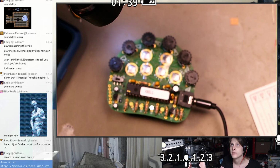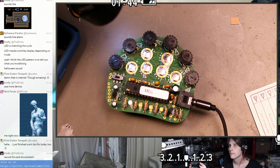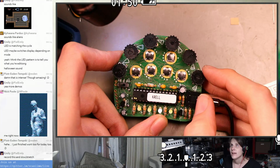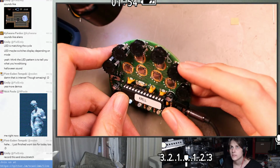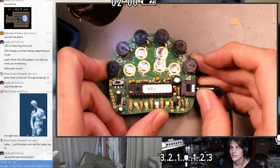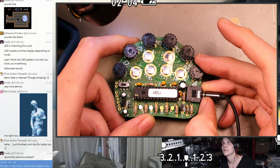And it's based on code that runs on this chip. This is a dsPIC microcontroller. So it's running code just like an Arduino that would sample all these inputs and then generate some audio. Unlike most Arduinos, this is somewhat specialized for signal processing, so it's probably a little bit better at generating audio than an ATmega, even though people do make pretty nice synthesizers on ATmegas sometimes.